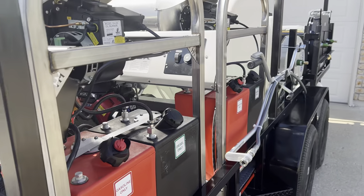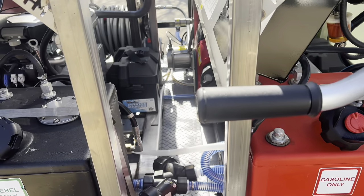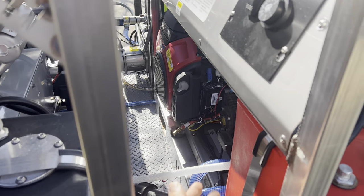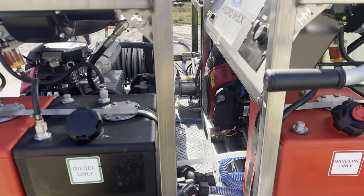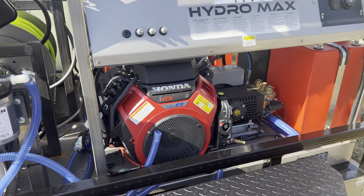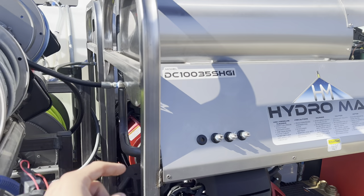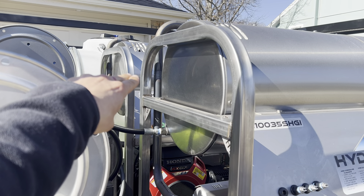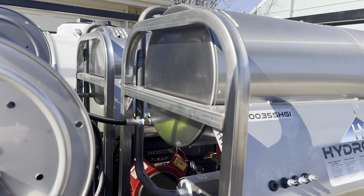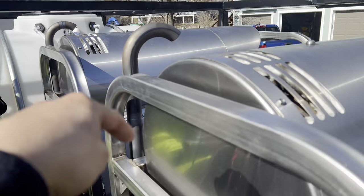I have one unit here and a second unit here. I can work between these units — I can actually sit down inside and work on my pumps. The machines have trap pressure unloaders because I tie both machines together in a siamese setup so I can get 18 to 20 gallons a minute. I've also redirected the exhaust to go up and over so it doesn't burn any of my hoses or wheels.